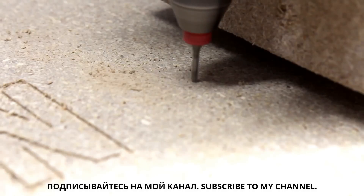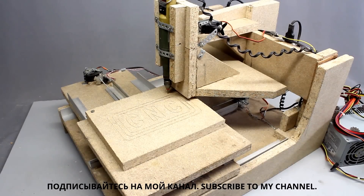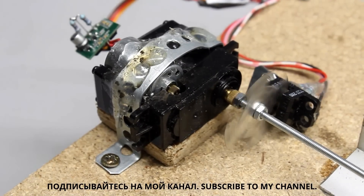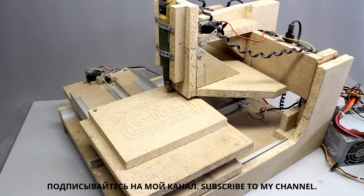This video is about a simple-to-build CNC machine. The machine has a work area of 20x20cm and a base area of approximately 50x60cm. It is controlled through an Arduino Uno and the axes are driven by 3 servos. The machine is composed of materials available in a do-it-yourself store. You can build this machine on a weekend using only a few tools.